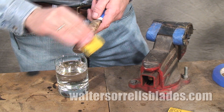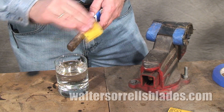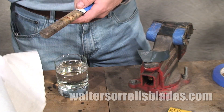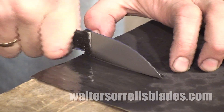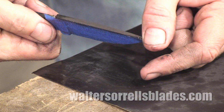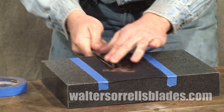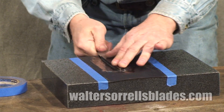Sandpaper wears out in a variety of ways. First, the abrasive grains break down, meaning their hard pointy edges start wearing away, so they cut slower — there's not much you can do about that. But sandpaper also loads up, meaning bits of the material you're sanding build up between the grains, causing the abrasives to skate across the material. When you're sanding metal, you'll increase the longevity and aggressiveness of your sandpaper by using wet or dry sandpaper and giving it a squirt of lubricant, such as WD-40 or 3-in-1 oil.